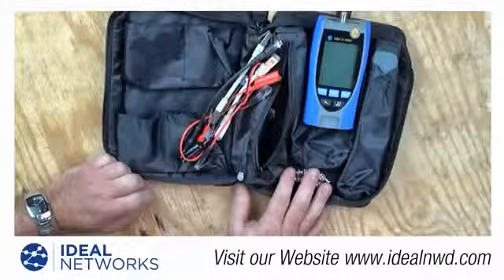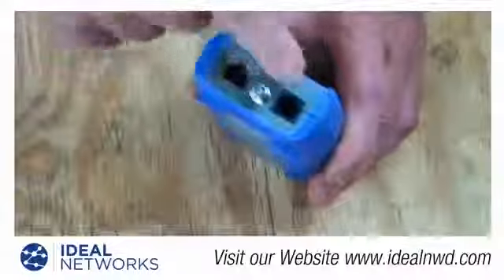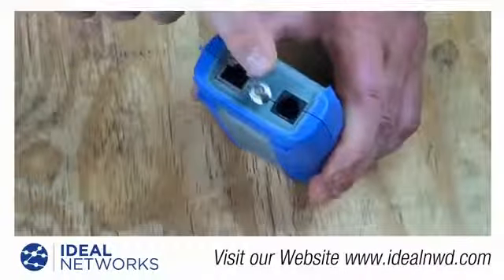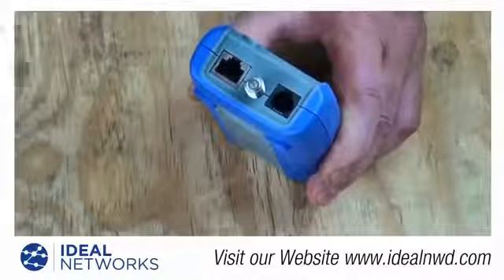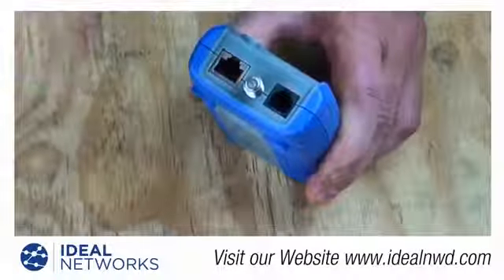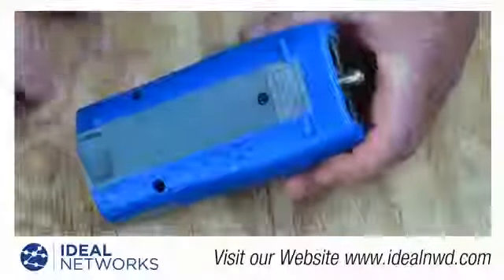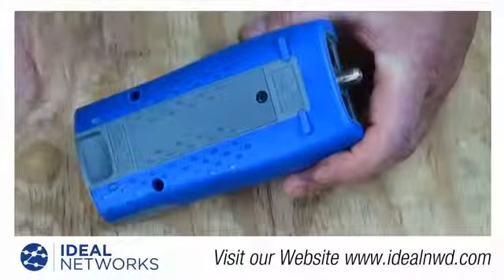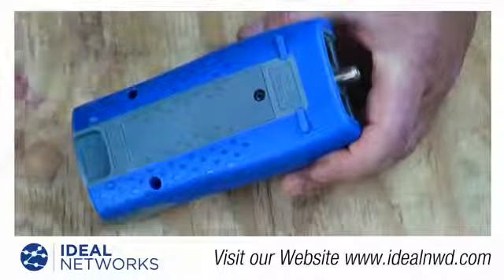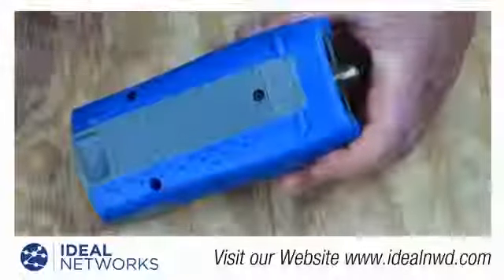Here you can get a good look at the VDV Pro tester. On the top of the tester are different ports: a phone port, a coaxial port with an F connector (changeable to BNC or RCA via adapters), and a data port. The data port has metal around it indicating it can work with shielded or unshielded category cable and test the shields as well. On the back is where the battery is stored — a nine-volt battery accessed with one screw. The specs indicate the tester will run for 20 hours of continuous operation without the backlight. The display will let you know when the battery life is getting low.